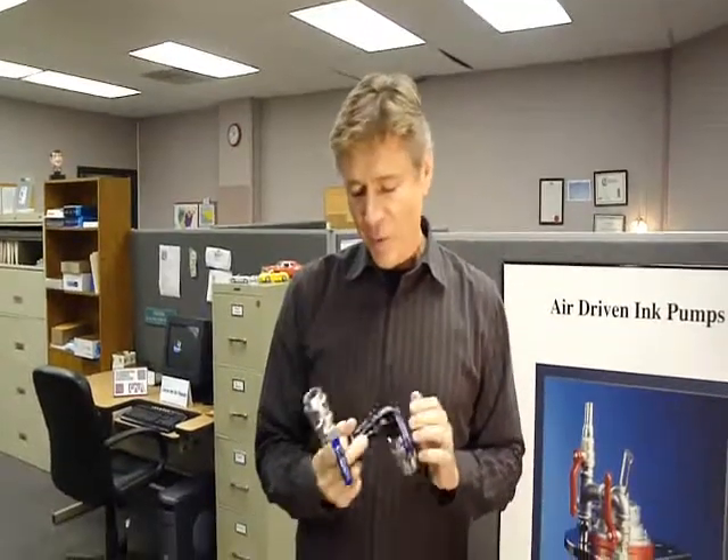This is the Powerwise Bypass System. It's supplied on every five gallon pump and is an option on the low flow models too. It comes with full flow bore valves. This is very important because you don't want to restrict the flow.